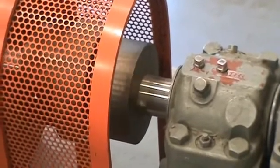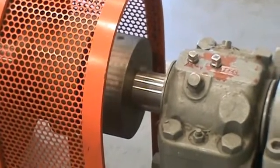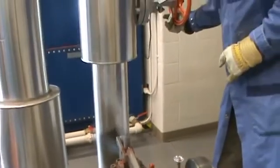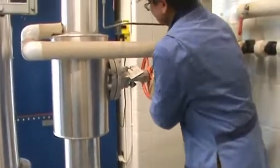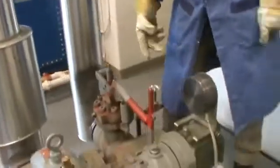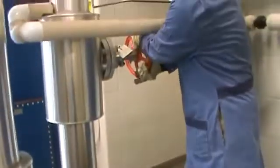Right now the turbine is slowly slowing down — we just wait a few more moments until it's completely stopped. I can see it's pretty much stopped now. I'm going to close the steam valve to the turbine and then reset the overspeed trip by pulling it up.